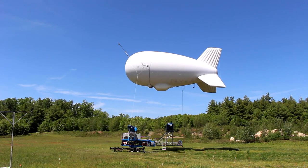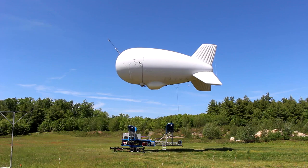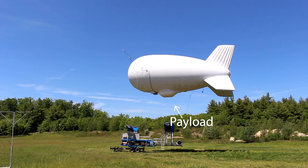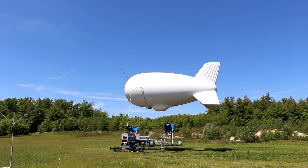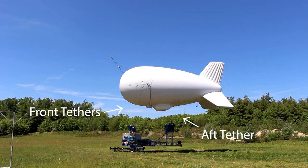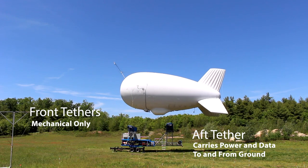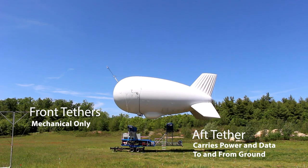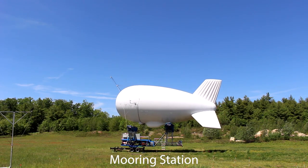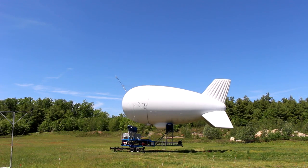The main parts of a super tower are the lighter-than-air balloon, filled with helium, which the payload is mounted to. Connecting that to the ground are three tethers: two are mechanical strength members only, and the third carries both power and data signals from up to down. All of that is attached to the mooring platform, which has all the motors and actuators as well as the logic — the smarts behind it.